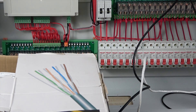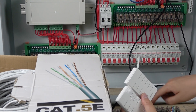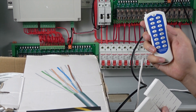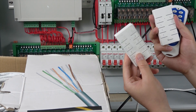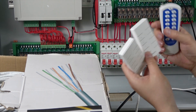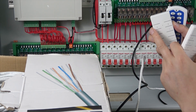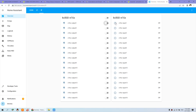You can also use a remote control with this board. It has 16 channels, so you can use a 16-button remote. You can also integrate remotes from different brands with the E16S board. You can define any remote button to turn on or off any specific relay — just set it by your code in ESPHome. In the Home Assistant dashboard, you can see the different buttons configured.